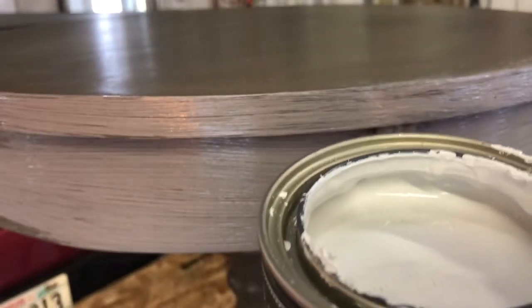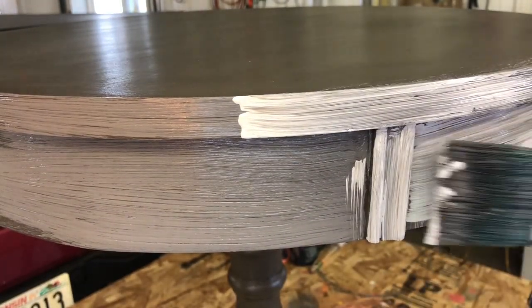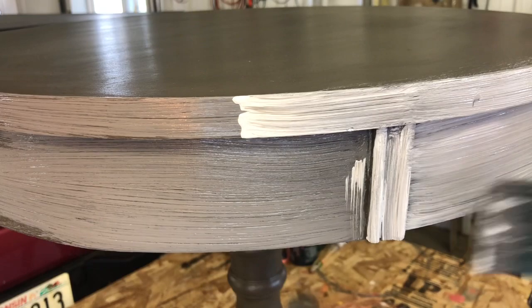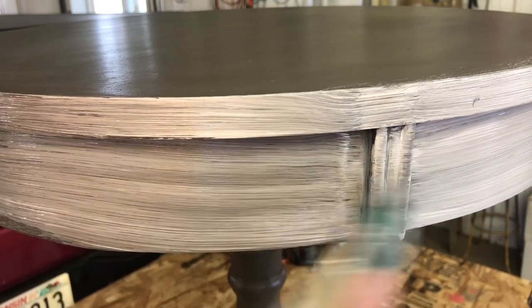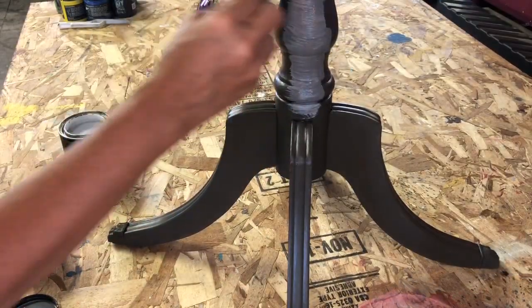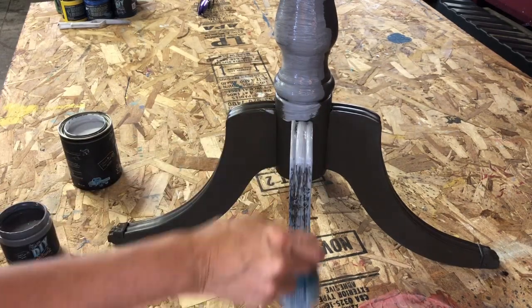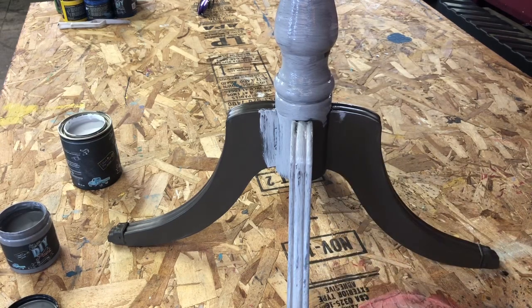While the paint was wet, I used beadboard and applied it right on top of the wet letterpress gray to give that kind of blended look — a little bit darker than white and lighter than letterpress gray. You don't have to get good coverage, because when you distress is where the character comes into place. I'm applying letterpress gray with the sampler DIY brush, which is my favorite.